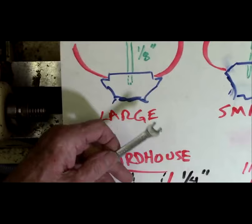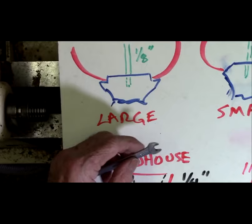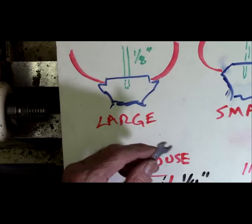it's a wrench, and I ground the points off of it so it won't grab on the lathe, and I thinned it out. I thinned it out to make sure it would go inside of where I'm cutting my slots, so make it fit. Previously, it was just too wide. That's great. I'll do the subtitles in the chat.